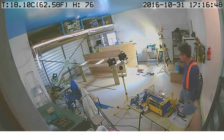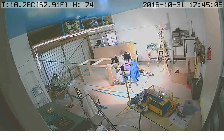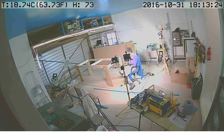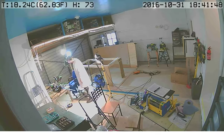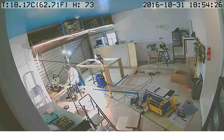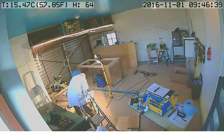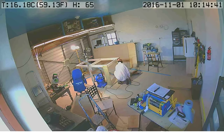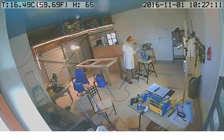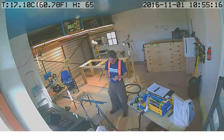Now I'm pushing on the frame to see how sturdy it is. Then doing a lot of planning and figuring — trying to figure out which angles should I put the angle irons in, which diagonal parts of this frame need bracing. Now I'm cutting those to the right length. You want to be careful and wear your eye protection when cutting metal. I used a bevel cut so that the angle iron wouldn't have any big right angles sticking out. After a while I learned to put my hat on so that hot metal shavings wouldn't go into my hair. I'm test fitting the angle irons on the frame itself to make sure they come out right, because the legs are not perfectly vertical and everything is not perfectly straight. It's good to have the braces match what reality is rather than my ideal of what it should be.